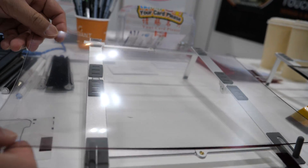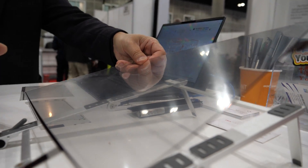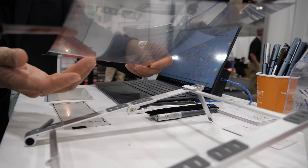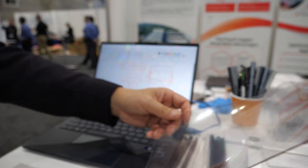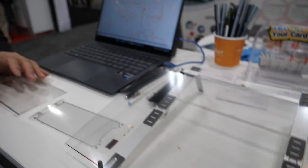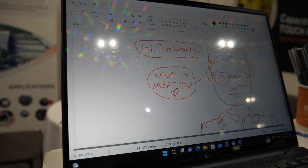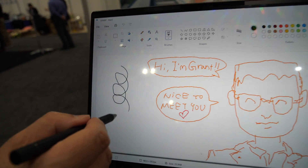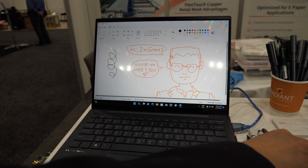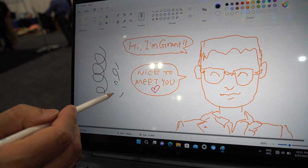What do you show here? So here is our product, which is on a very thin film PET, 36 micron. You print the sensor, which is copper-based, on both sides, and you cannot see it because it's so small, so thin. The line width is only 2 to 3 micron, and this is the thinnest in the market. It basically provides better performance, and this one actually shows our sensor installed in this laptop, and you can see that we can use different pens to draw patterns. Most importantly, we're demonstrating a feature where it allows a pencil to actually work with this.